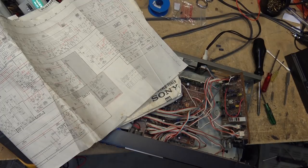They only have a range of, you know, I can pick it up in my car about one lot over either side of the house. The signal is really, really weak. It's not like FM. If you had 400 milliwatts on FM, you'd probably pick the thing up through the entire town with a half-decent antenna. And I'm going to be building an FM transmitter, too. We'll see how far it goes. But AM doesn't go very far.